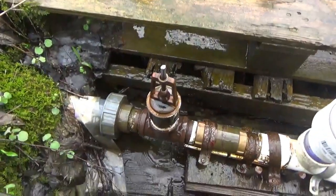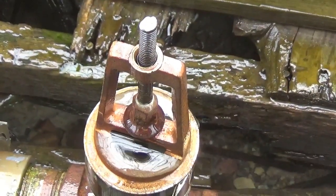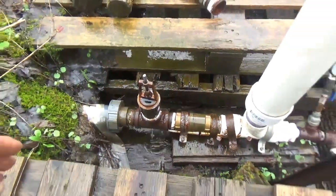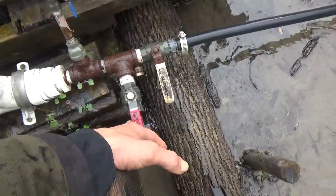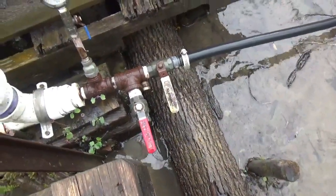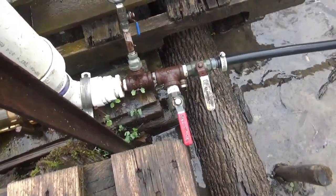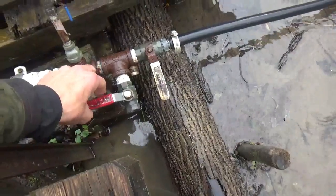Have a look at that valve quick. You can see this spring's recent repairs — holding up nice. Not running any weights, not in high water demand right now anyway with all the rain. With the bypass on and the dump bypass here on, and the delivery line off so we don't dump a hundred-some gallons of water back out of the upper reservoir, I've drained the chamber out. That should give us some air volume in the pressure chamber and take the shock back off the system.